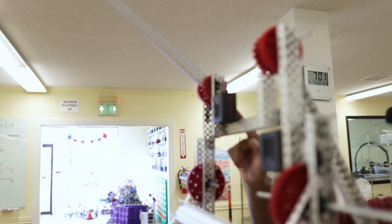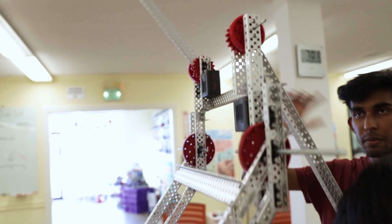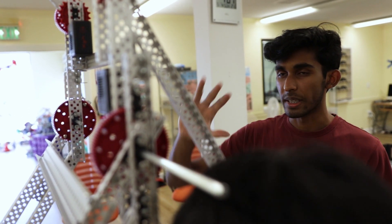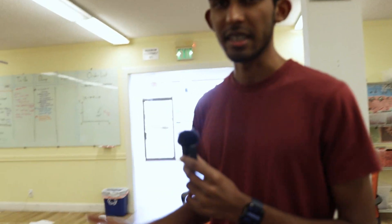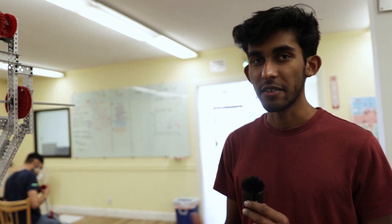On the top we're just doing a chain bar — right now we're running a 100 RPM motor on a 1-to-5 ratio. We're thinking this should definitely be enough torque to move our manipulator. The manipulator is kind of heavy, so that's why we're going with this kind of setup, but again this is all subject to change based on how our testing goes.